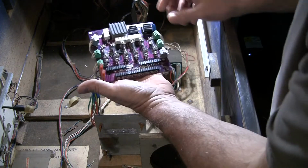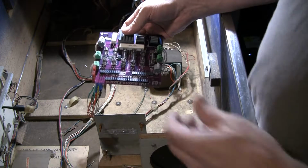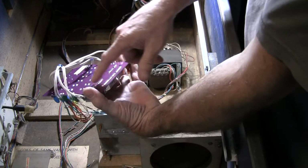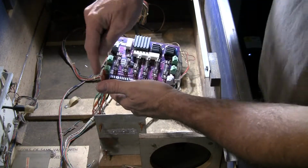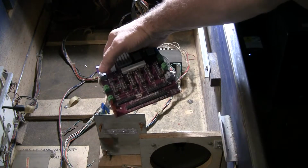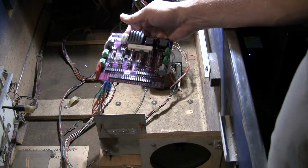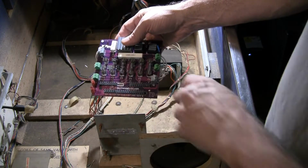So this is the X-Pin, and it is a revision A. And this board's claim to fame is that normally you'd solder these onto these points on the back, like you see here. But this is a solderless board in that respect. So you use these push terminals, and you push down on the little things, and you just insert them in. You cut about 1/4 of an inch of the wire off of it, and then all the rest of the other stuff just plugs in here.